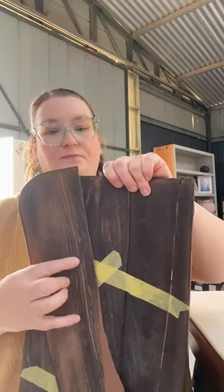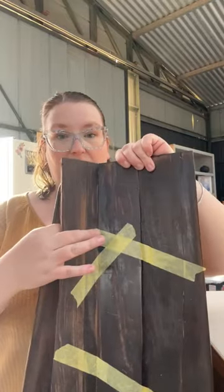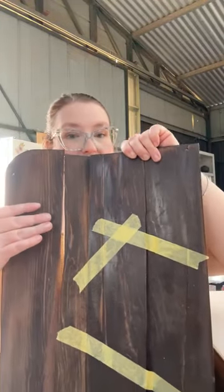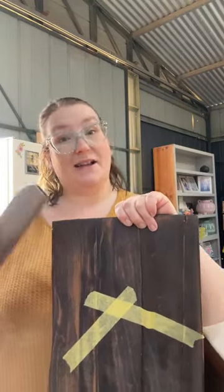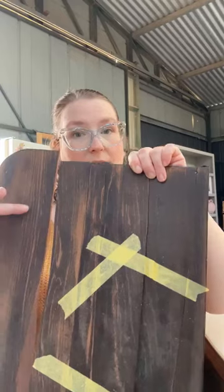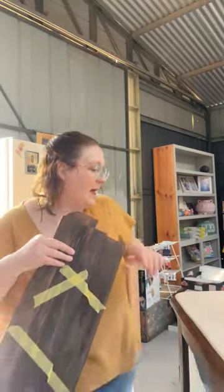So these are all the pieces — it was already broken, it had a massive crack and I couldn't leave it as is. It had to be replaced. That's the original top. Whenever I pull tops off a piece, if I can, I try to salvage them so I can use them as a template to cut a new top — it's the easiest way to do it. If you can salvage your pieces, put some tape on them or number them, especially if they come off in multiple pieces like this one did.